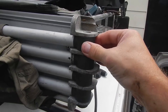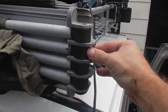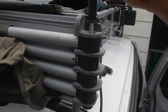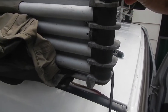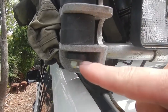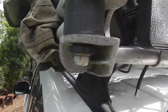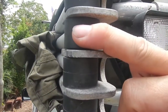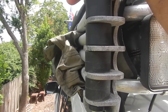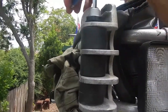So right now I'm happy with that, so we're just going to slot that back in. One thing to notice if you do have to do these: you can actually pull these up a little bit — they don't come out of the material at the other end — and that just gives you a little bit of room to work on this end. So push that back in, align them up, wrap our pin with the spacer in it. We may need to adjust these because I have removed a few. There goes our bottom spacer, but that top one's all but in. Just your nut on the bottom, which is a lock washer — you don't want to do it too tight. The whole lot should rotate, so it's not tied up, otherwise you're going to put tension on these and they need to spin out. Leave a little bit of slack in that — don't tighten it all the way up.